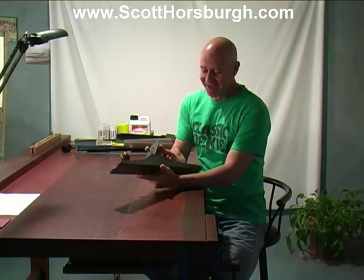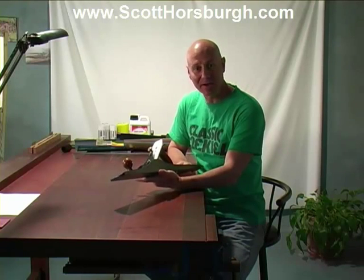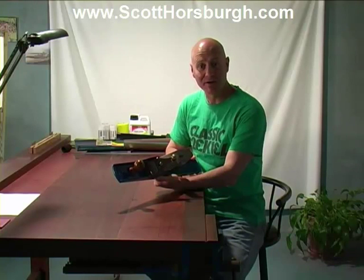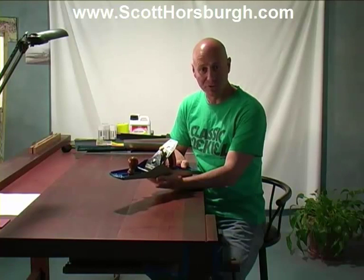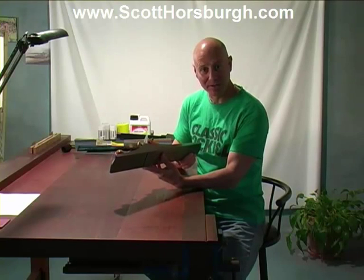The hand plane. This is a very beautiful, simple tool. When I first started to use one of these, I was very apprehensive as to how accurately you could take shavings. I would machine up a piece of wood and plane a face side and a face edge on it. The face edge would be planed on the surface planer using the fence to get it nice and square and true. And I was initially of the opinion that you shouldn't mess with that board. It's been done by a machine and it's perfectly accurate. There is no way you will be able to get it more accurate by putting one of these onto it.